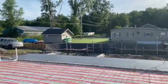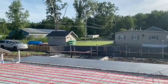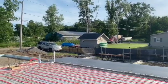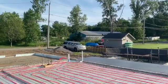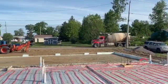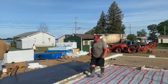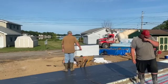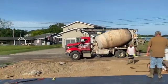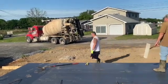Here comes our mud rolling in — Circle T with the conveyor. We got a 4,000 pound mix with fibers and a superplasticizer high-range water reducer in there, so we're going to pour it at at least a six to seven slump. We got Big Rob today from Circle T. If you're in the local area, their number is 315-963-2231 — they've been taking care of us real good this year. We're going to back him right in here and shoot this whole thing from that area.